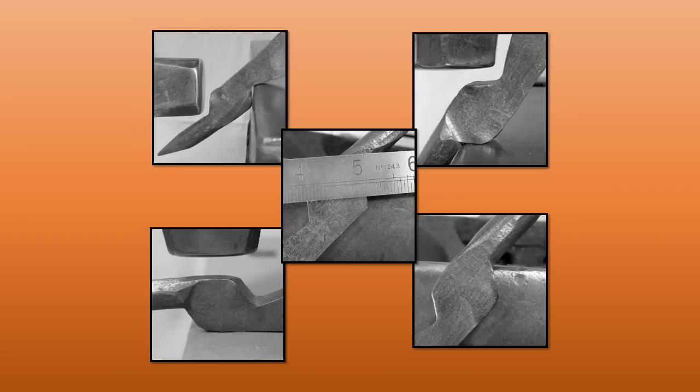What we're going to do now is dress the pair of tongs. I like a rectangular or rhombus-shaped boss; common wisdom is to have it round and that's fine, but I'll show my way — if you want it round, just knock the corners off. The first thing I'm going to do is step with my hammer leg towards the anvil and put my shoulder more over the offside edge. That changes the angle of the tongs. I'm now engaging my shoulder so the tongs are lifted up a bit. I want a good heat running all the way through the boss because we're going to upset through it.